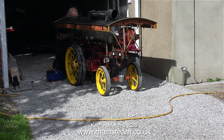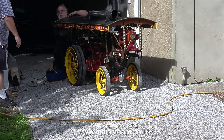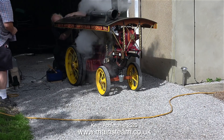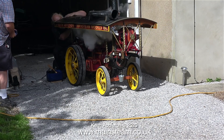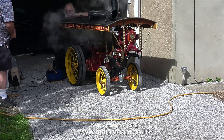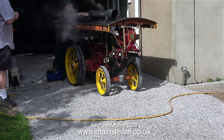But all I got from the siren once again was steam and no sound. My friend Graham was less than happy when I pulled the chain to blow the siren and covered him in scalding hot steam. The siren is still not working. When I finish this morning's edit, I will give the company from whom I bought the siren a ring and ask them why it's not working. There's plenty of steam going through it, but the small rotor inside is not actually rotating. Later today I intend to remove the siren and see what's going on, or not going on.